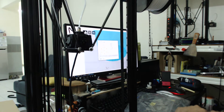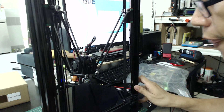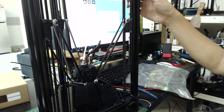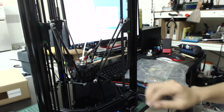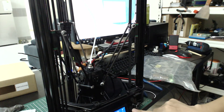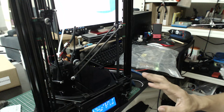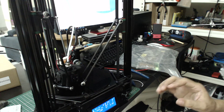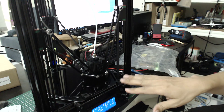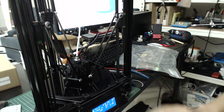The calibration will start running. You can see there is an end stop for the hotend. If anything happens, press the reset button — everything will stop, including heating. It will stop and not work at all; this is just for emergency stop. It looks like it's working fine, so let it run a few times to find the right spot on the print bed.